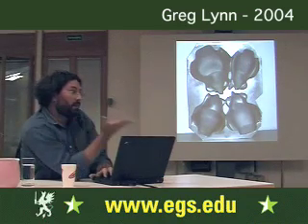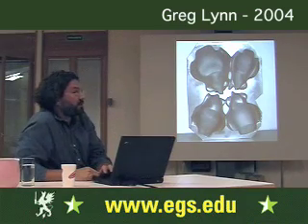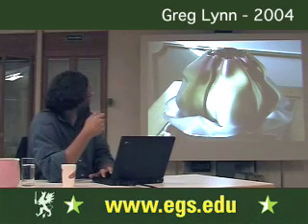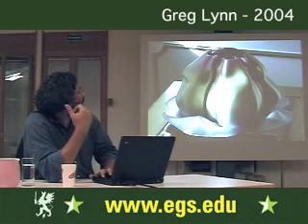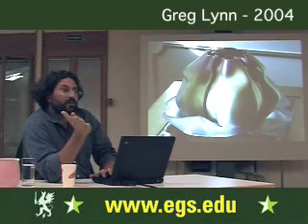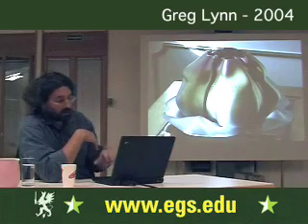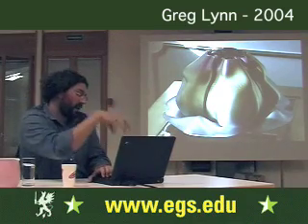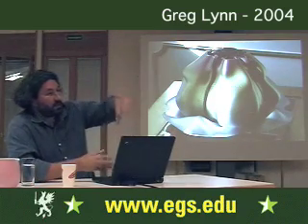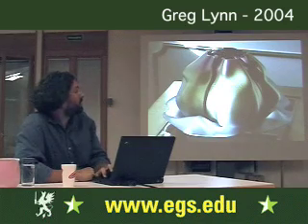We take them out of the form and give a robotically controlled plasma beam the path to cut them out. It cuts them out and welds them together. To color them — when you deal with a curved surface, a gradient of color always looks better because it accentuates the highlights of the curves more than a single color. We then plated them with an acid etching system where we change the voltage on a bath as we pull the things out.